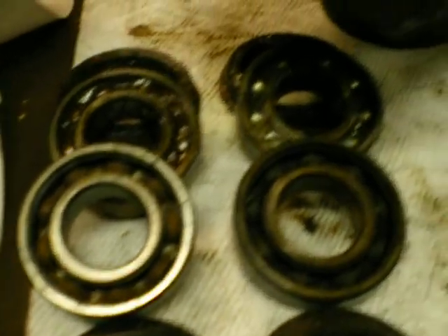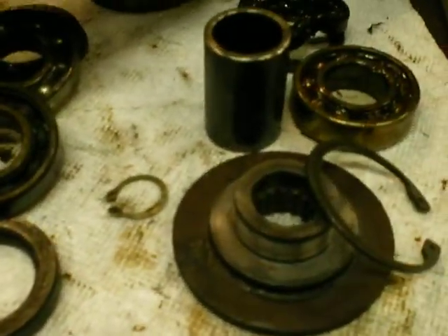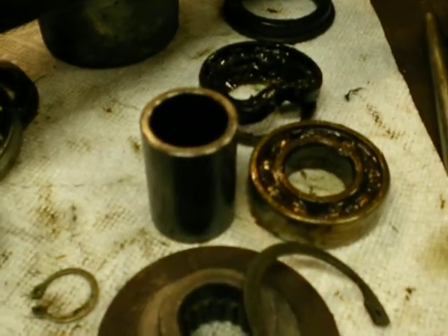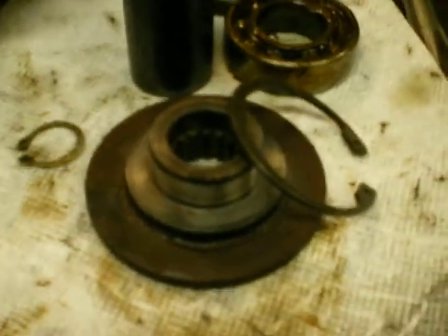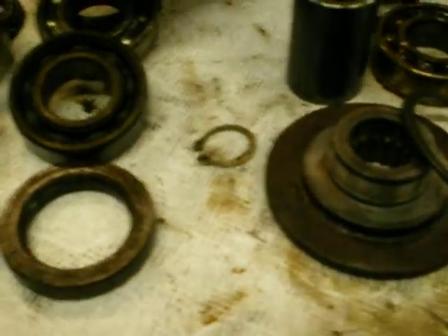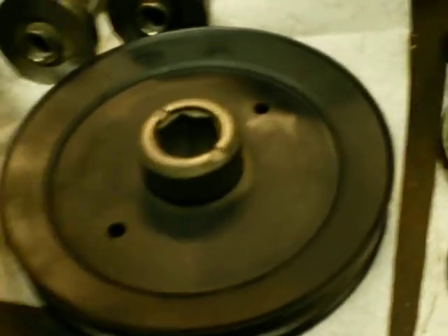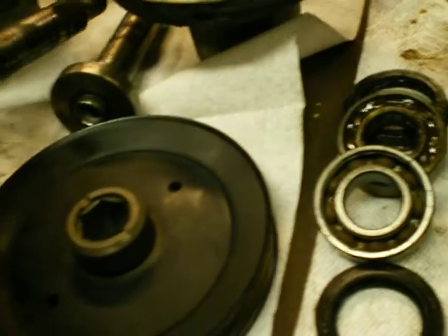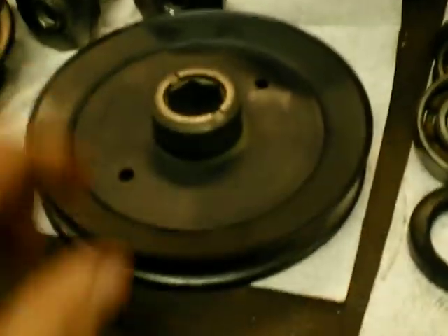You can see when I took them apart. The only regret here is I wished I would have filmed and showed you the noise that it was making prior to the disassembly. This disassembly was pretty easy. There's a nut on the top of the spindle shaft, and you remove it, and the spindle shafts have a hex inside. They slide right off of the top of the spindle shaft. The bottom side fits inside of the seal. Pretty simple.